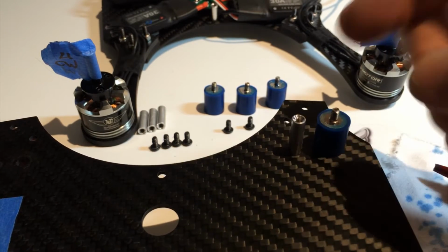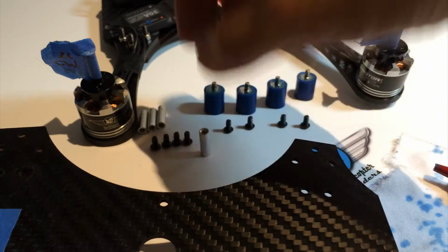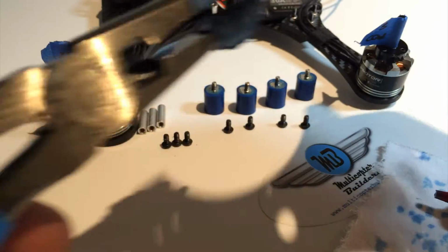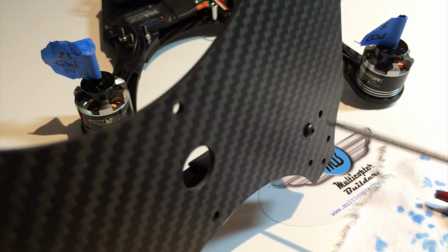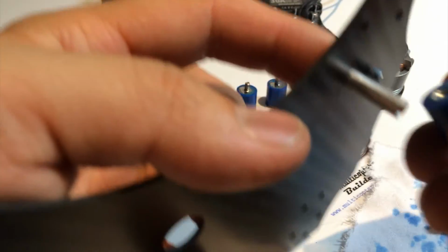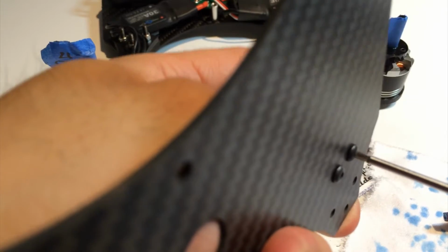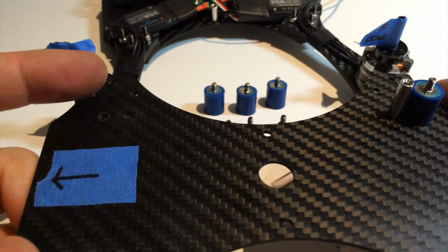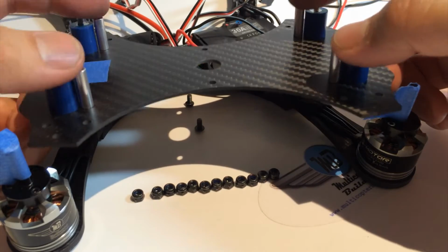Now, you want to install the aluminum one first because they actually sit quite close, and you're going to need to be able to get the pliers in there to get a nice tight fit. The rubber elastic band tipped needle nose, and we'll tighten that in. Now next to it is going to sit our bobbin. Like that. So we're going to do the same for every side, and it's going to be the standoff on the inside and the bobbins on the outside. So we've got all 4 bobbins and all 4 aluminum standoffs set.